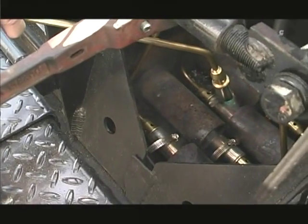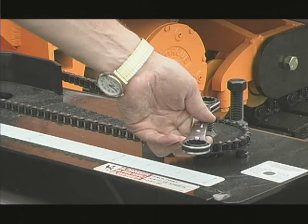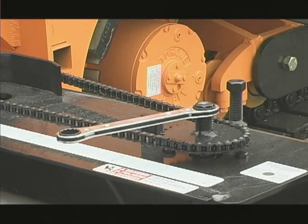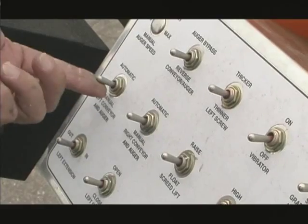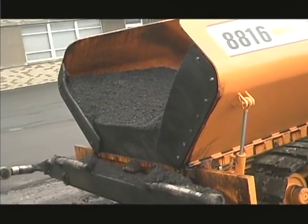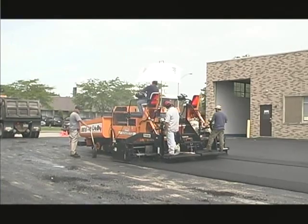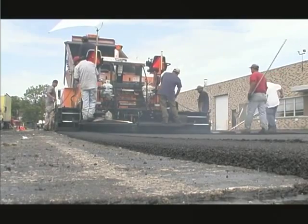The screed extensions should be heated before they are adjusted to extended width. Adjust the tilt on the rear edge of the extension by turning the adjustment nut counterclockwise with a wrench. If drag occurs in the center of the screed, too much pressure is being applied to the extension, causing it to bear all of the weight. If this occurs, turn the adjustment clockwise until both the screed and the extension produce the same matte texture. Open the hopper wings into working position. When you first start to pave, allow only a partial load of asphalt to enter the hopper. Set the left and right conveyor switches to the automatic position to convey material back to the screed. Open the cutoff gates behind the auger and begin paving. Move slowly at first so adjustments can be made to the screed. Run the paver from one side only, either the left operator's side or the right. For safety, wear OSHA-required safety equipment when operating the paver.